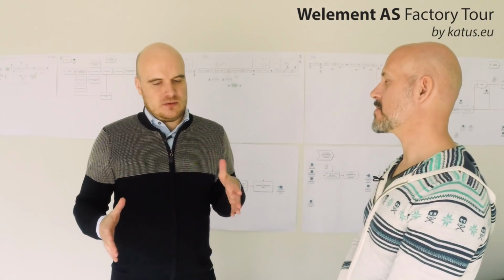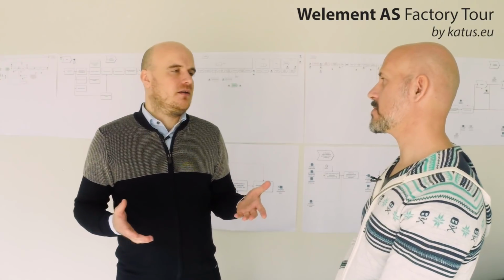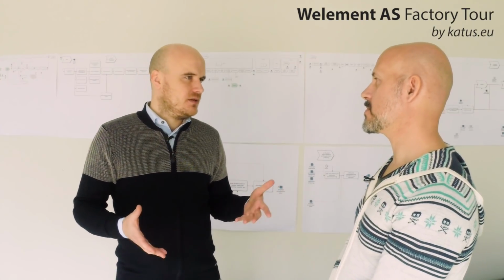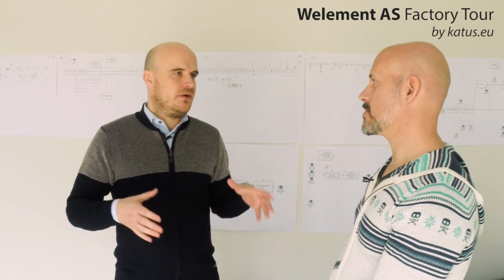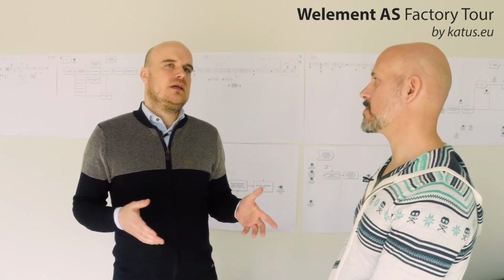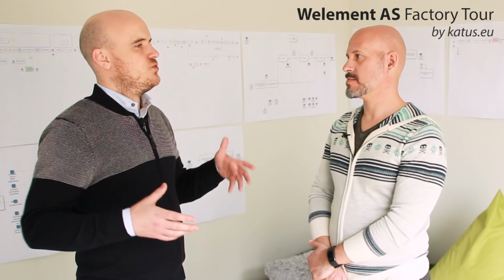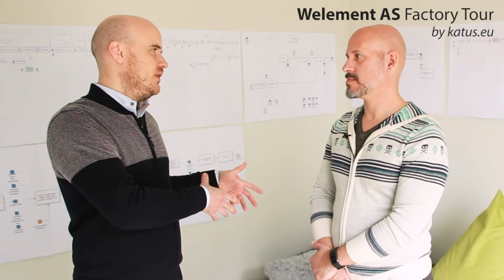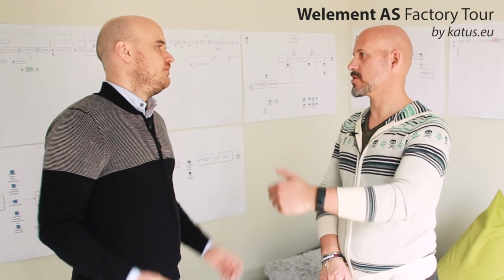But at the moment, the main features of the bridge, like I mentioned, are nailing, stapling of gypsum, cutting the boards to measure on the element, and cutting out window holes. It can also be used just for marking. So let's say we need to use screws somewhere that we can't use with the bridge, then you can mark out the line and screw it manually.